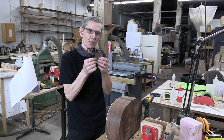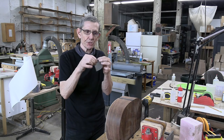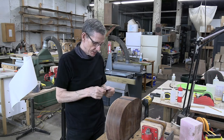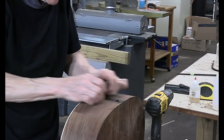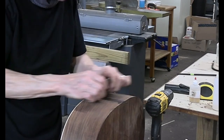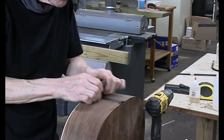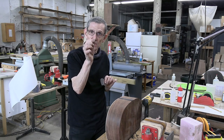When you sharpen that edge with the sandpaper, it puts a nice burr edge right there. And if you don't believe me, check this out. This is evidence. And you know your scraper's sharp when you get little curl shavings.